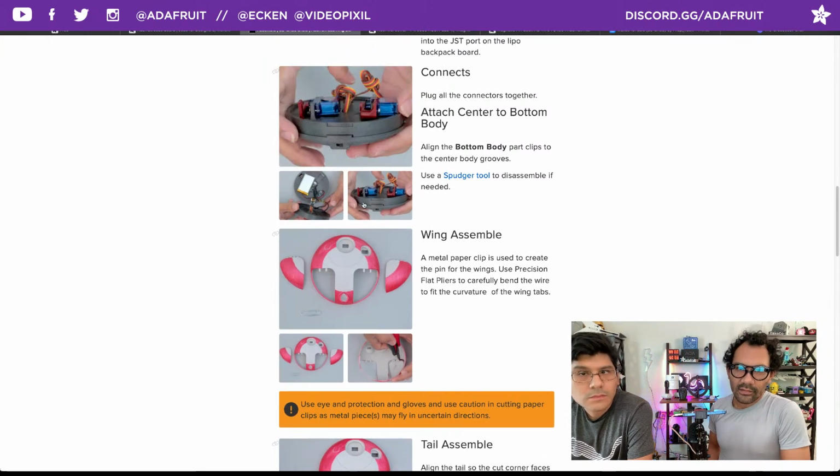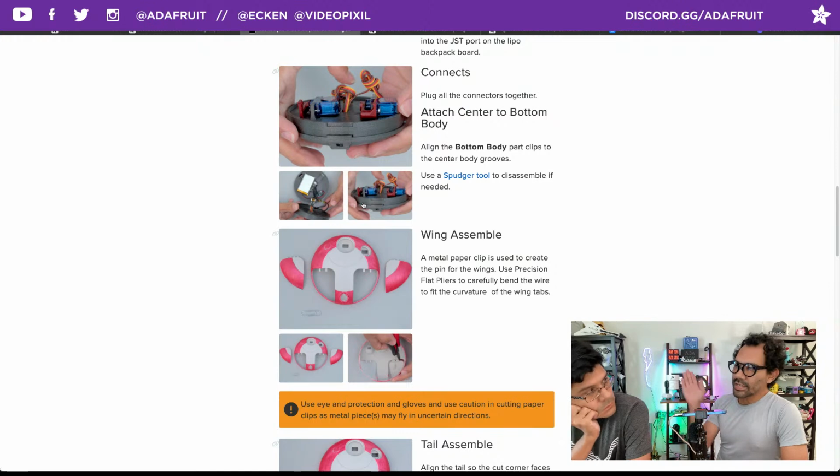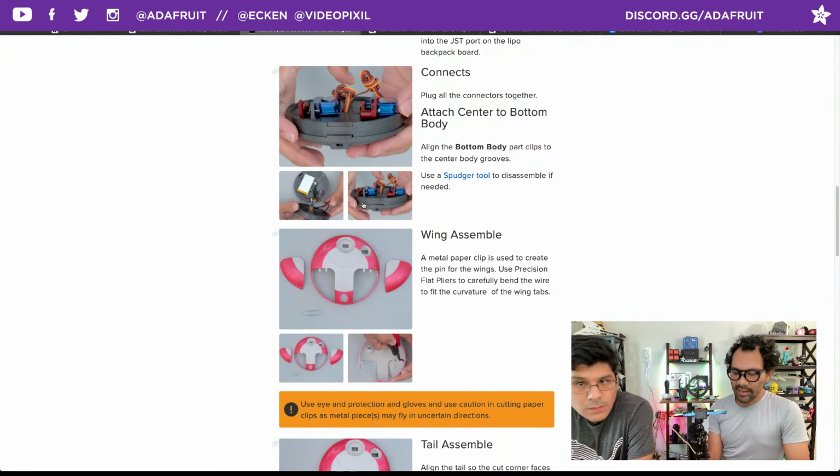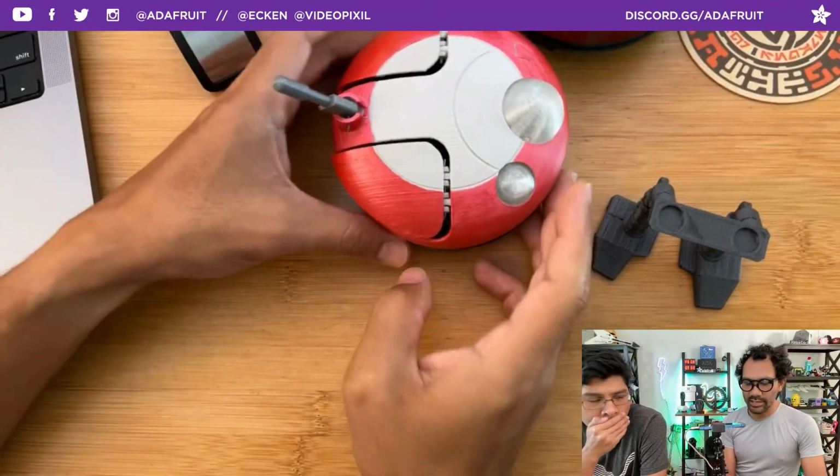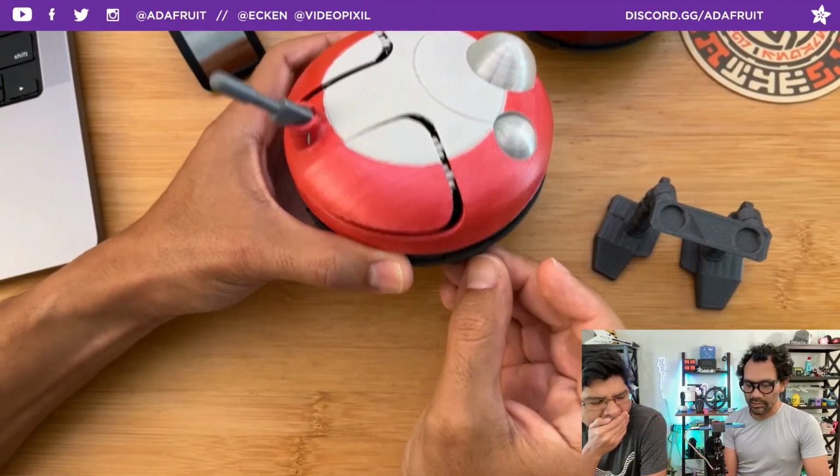And here's where you can test out the servo horn arrangement. When you turn it on, it'll reset its position. You'll hear a noise, because it always goes back to kind of zero, it starts back at about 7. As soon as you hear that noise, turn off your circuit so you can arrange how your servo horns are.